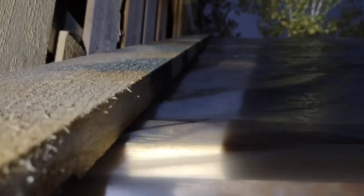That corner piece fit in nicely and we're ready to move on. I got my strapping screwed on at the top, and now I'm going to line it up with the piece of strapping underneath on this edge, make sure the plastic is tight, and then screw it down at the bottom. That should give me a good hold on this side as I go across the roof with my strapping. I'll pull the plastic tight, then pull it a little bit this way at the bottom and put a staple in before going back up to put the next board on — that way I know the bottom is held fairly straight.